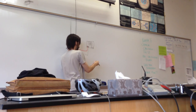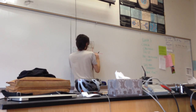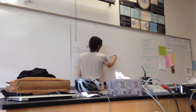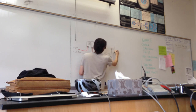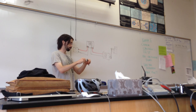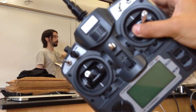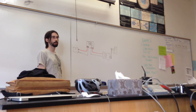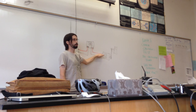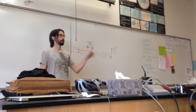You have four-gauge wires, which are also pretty big, and they connect to the motor. So here's our motor — this might be connected to a gear, connected to a chain, connected to an axle, connected to a wheel, whatever it is. There's some kind of mechanism that the motor connects to. What happens is the controller takes the power coming from the battery — which is 12 volts at some high level of current — and the controller basically controls the amount going back out to the motor. This allows you to speed up or slow down the motor and run it in forwards or reverse.